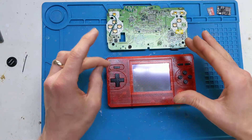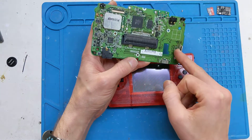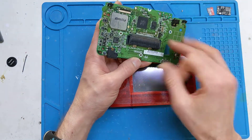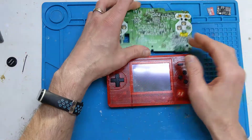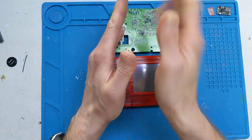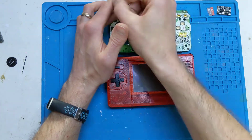If you don't know, what you do is cut the signal line — there are two signal lines, one for the top screen, one for the bottom screen. You cut the signal line going into the bottom screen, slice that off, and solder a wire onto there so you can pipe in whatever signal you want. So you can pipe in the signal for the bottom screen or the top screen, which is quite cool. What you normally do is have a three-pin switch: the line takes off, goes to the centre pin, and then the left and right pins connect to the top screen signal and the bottom screen signal, so whichever way you switch it, it'll go from top to bottom screen.